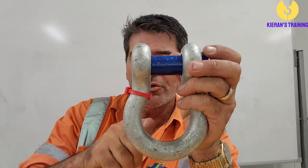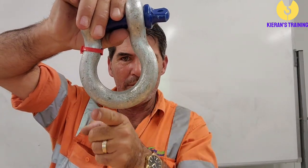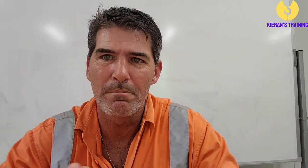There's one thing that doesn't get told too often: with the pull on the bow shackle, it shouldn't go past the 45-degree mark — so about there on either side. You can't have the slings pulling way up high; they're not designed for that. From the centre, 45 degrees up in either direction is generally the maximum angle that should be used on a shackle. Some shackles will even have a marking for this, some don't — but 45 degrees should be the maximum loading, as they're not designed to be pulled to the side. Don't forget to like and subscribe and keep tuned for further videos.